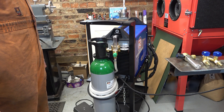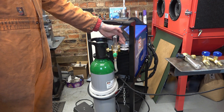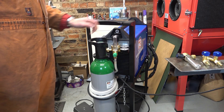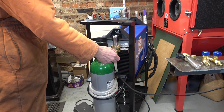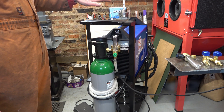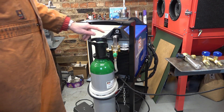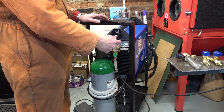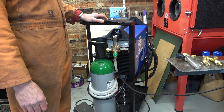Here's my gas setup: a 10-litre bottle, a regulator with two dials — one showing the cylinder pressure, the other showing the flow rate — and then a flow meter with its individual control. It's a bit cramped here. When I get a new cylinder, I'll go for a 20-litre. This regulator is marked off to 25 litres per minute, but the markings are on this side and they're very difficult to see from the front, which is a bit of a nuisance.